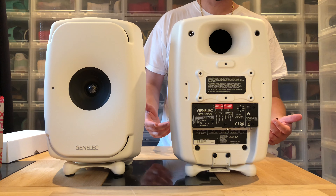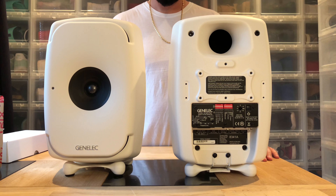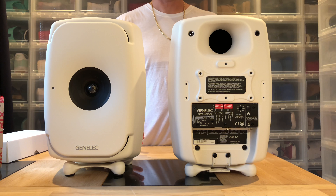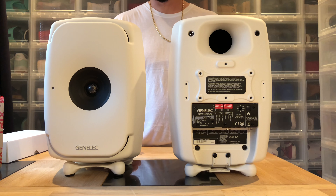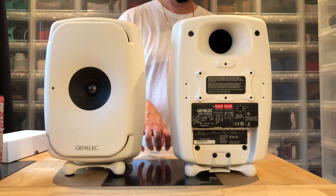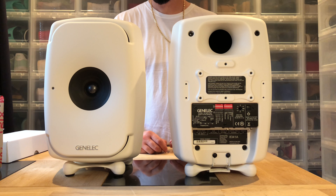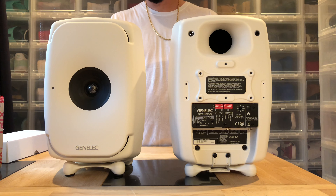Here you have the front side and back side. If you don't have the calibration product, you can do it all with the DIP switches here — you can adjust the speaker according to how close the wall is, how close the corner is, how much bass you want. It's like an equalizer but much more advanced. Underneath you have all channel connections, both analog and digital, because in a studio you very rarely have only two speakers — you can plug in as many as you want and they will recognize each other.